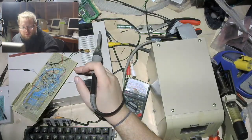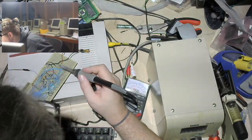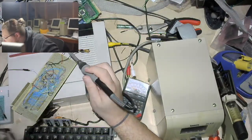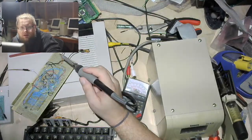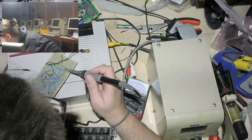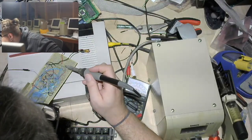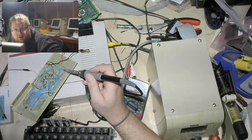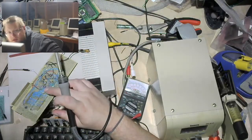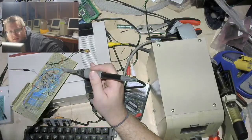Okay, so those seem fine. Those match the software. Everything is mapped up now and clean, which means also that I have, if I'm reading and remembering correctly, three free potential inputs or outputs left. Yay, on that side. So that's good. And then we should probably consolidate some stuff on the input side. So one was our clock, which we will wire up when I get the RAM chip enable over there. And then we had program ROM chip enable. Wait, no, sorry. That is the chip enable coming in from the NES. That looks fine.